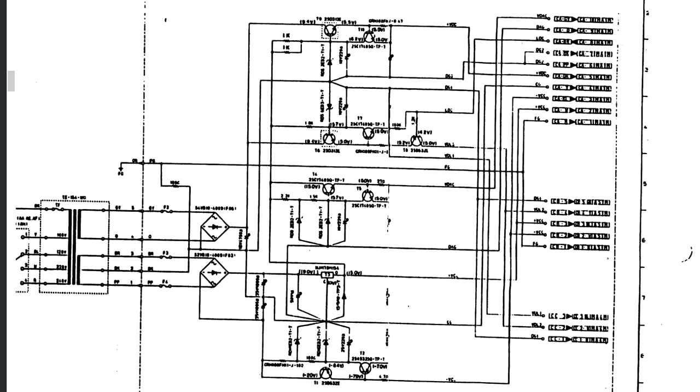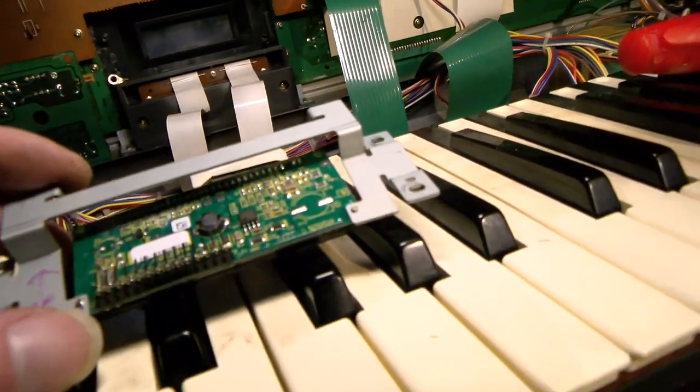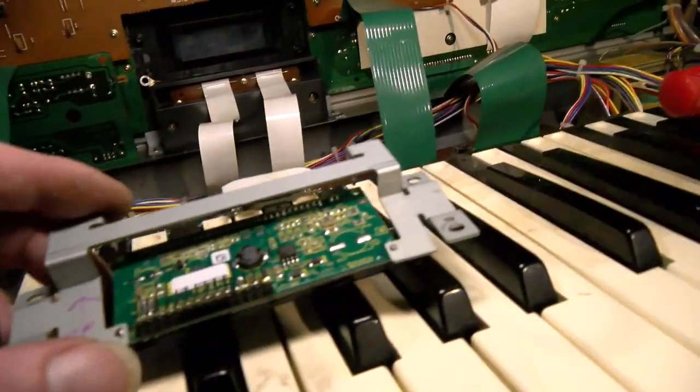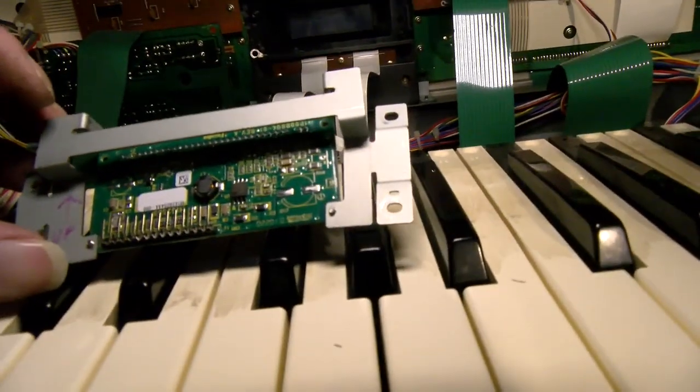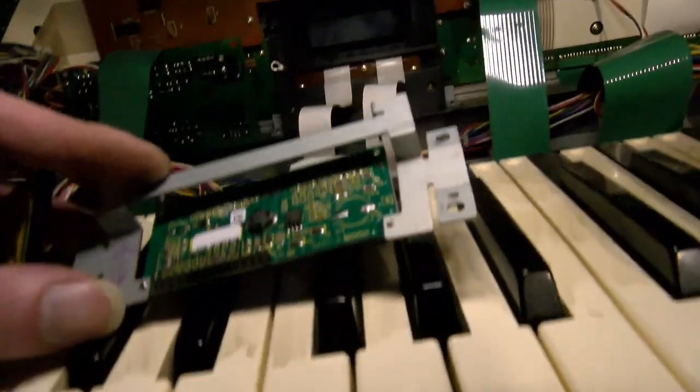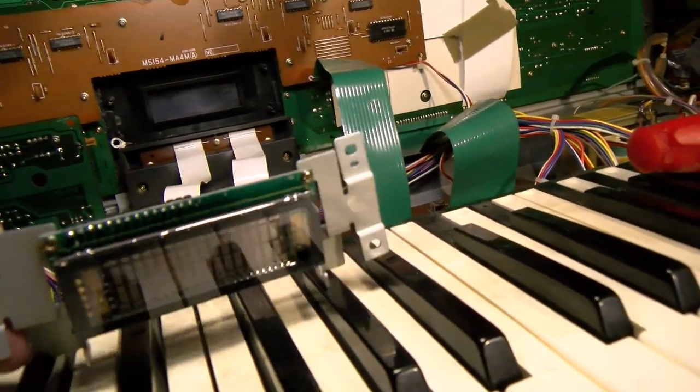And if that happens, you're going to end up feeding unregulated voltage, about 15 volts, into the instrument's digital supply rail. I really don't need to explain why this is a particularly bad thing when it's going to be at least 3 times the intended voltage for the electronics in that circuit. There is something to be said that a Zener diode would probably just start conducting massively and a fuse would blow, but that's going to take a little while if it happens at all. And so I just don't really recommend taking this chance if you're at all worried about breaking the instrument.